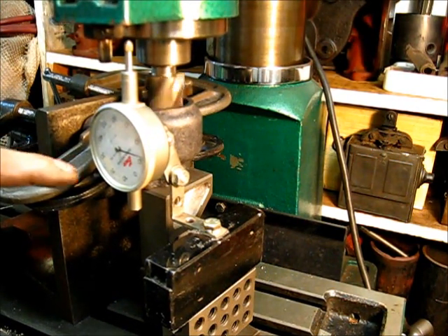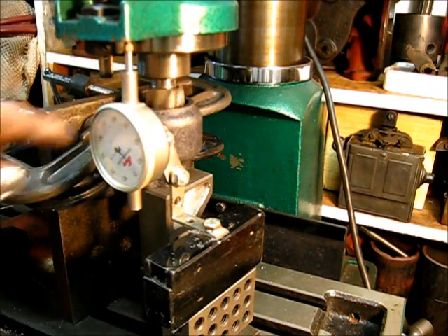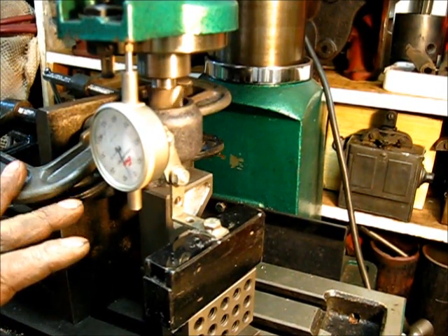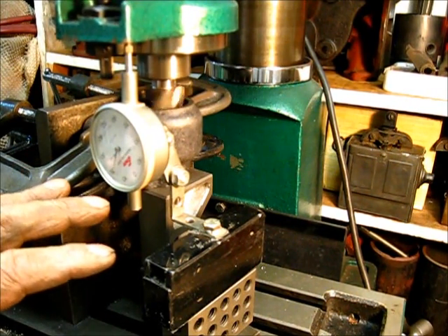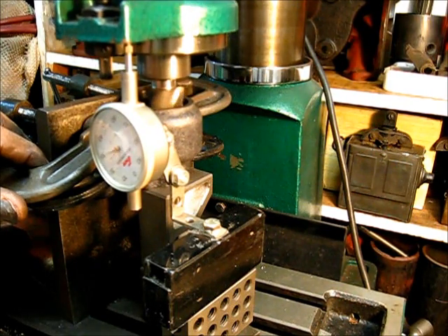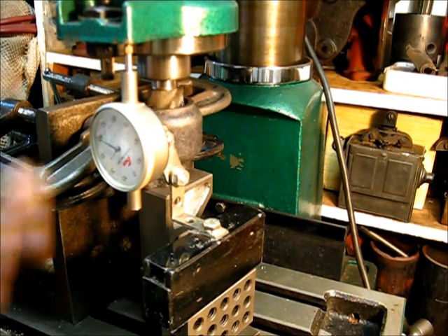You can see when the cutter makes contact, this will be on zero. That way I know how many thousandths I'm taking off. And this right here is kind of one of those where feel — you can actually feel it, you can actually hear it. That right there, that's 35 thousandths and that's ample enough. I can feel that it is smooth.